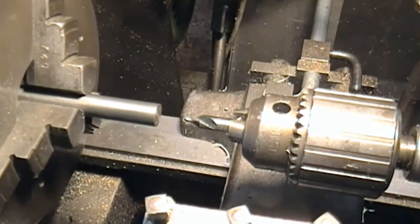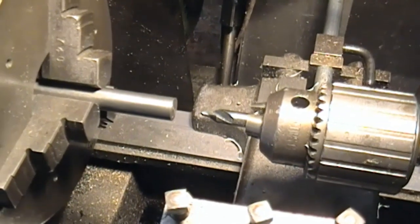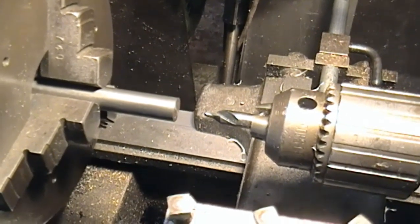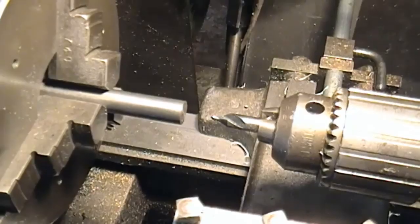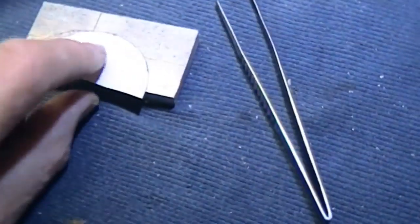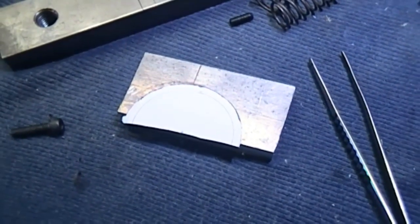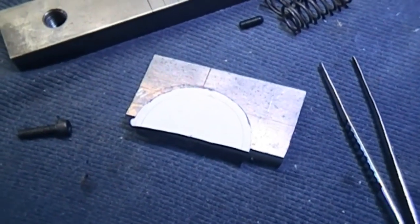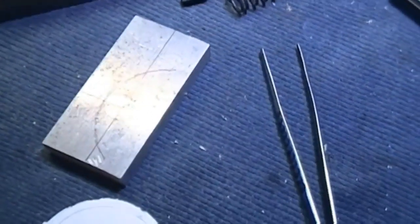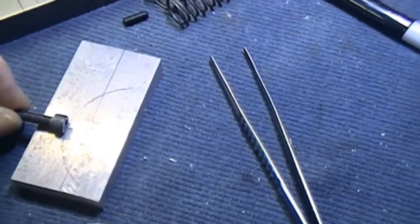Right, I'm going to recap on what I'm considering as a sequence here. I'm not going to video all the stages - it'll get too tedious. I'm just about to drill this piece of half-inch rod, get a thread in it which is going to hold the brake shoe - shall we call it - and then I shall make the brake shoe. This piece of paper represents the diameter of the spindle plus an eighth of an inch for a cork lining, and I've got to cut this piece of aluminum down. The cap screw here will be recessed.